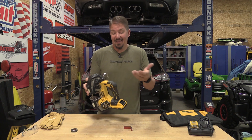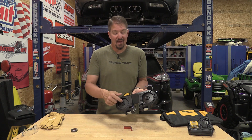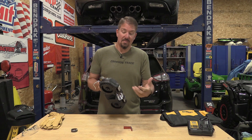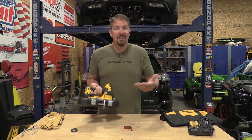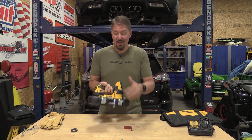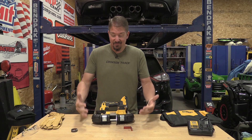In fact, I can't think of anything really here that I would change except to maybe add a little reaming tool on the end of the drive wheel — that would be nice so you could ream out whatever you cut if you're using it for electrical. Other than that, this thing has everything that you'd want, especially since you can adjust your blade tracking, which many of these come out now and you can't. You do have a metal frame around this guy, so it is very sturdy.